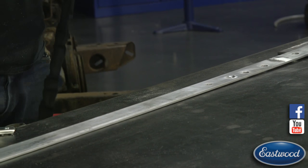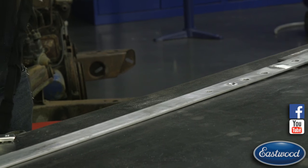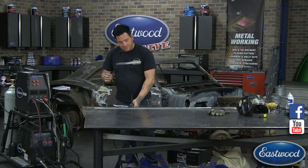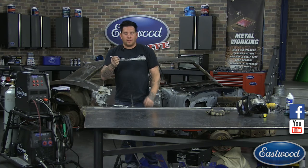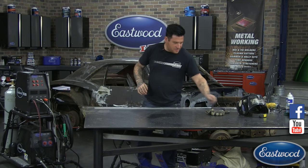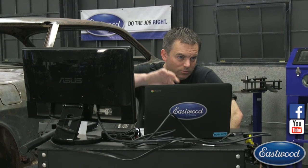If we're doing 1/16, I could have it sharpened and I lower amperage and I could be even closer to the piece. But you want to make sure that you have it. I wouldn't go much more than the height of what your filler rod is. That's a good question. And Bob would like to know, what's the technique if the metal was vertical as opposed to horizontal?